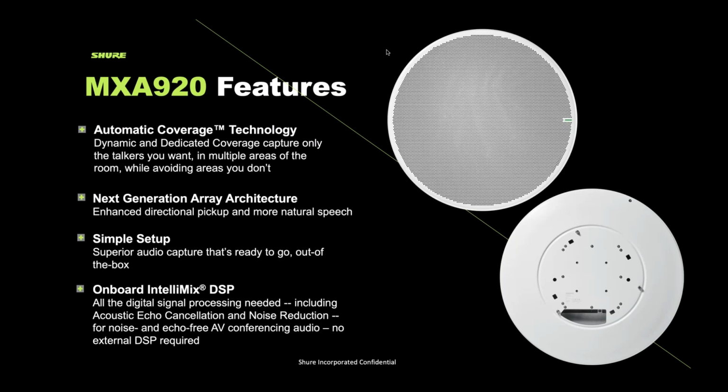And then there are two pieces of software that we're going to be looking at, or? We are going to be using the IMX Room software, which is kind of like a digital P300. For everybody out there, the P300 is our physical interface box, if you will. It does all the Dante routing. It has analog I/O, and then it has the USB connection, which is what you would connect to your computer or to your soft codec.